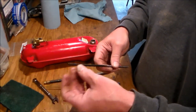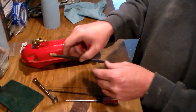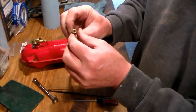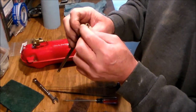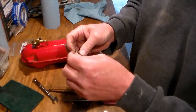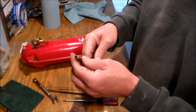The idea is just to clean the gunk off of it. It doesn't have to be shiny, it just has to have all the stuff knocked off of it and it'll be fine. The tube has that very fine little orifice in the end and that can get clogged up. Don't attempt to take a needle or anything else and push it down in there to clean it out — you're not going to be able to do it.